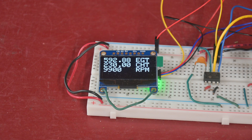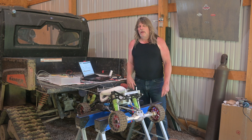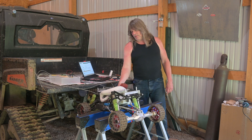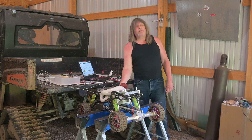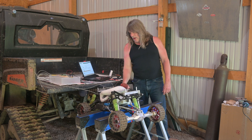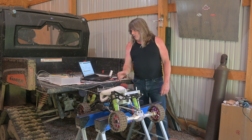You can definitely see that when you start hitting a little more throttle it jumps up in temperature. All in all I would say this is good to go to the next step, which will be the RPMs. I wanted to go off a hall effect sensor initially on a magnet inside the flywheel, but I may have a tough time getting the cable out without machining the block — I do not want to mess that beautiful Taylor up. So I am looking at tapping into the primary side of the coil and optically coupling the signal back to deal with that.